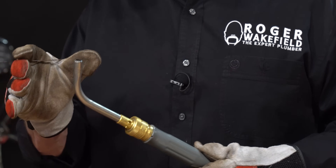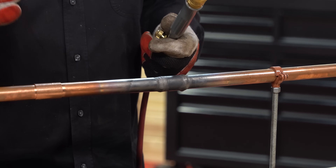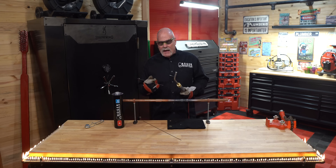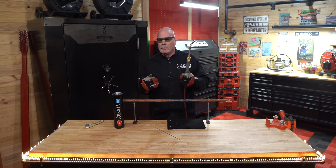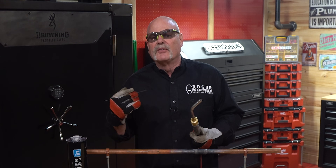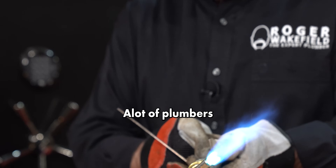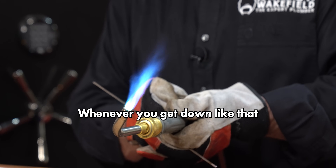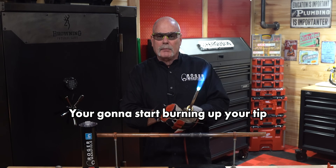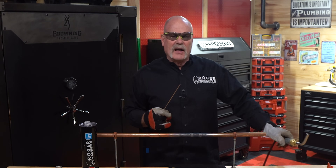You don't want to oversize your tip or just burn the heck out of it. I got it hot enough to braze and it brazed very easily. You've got to have a little more control with the Rosebud because you can adjust your tip and adjust your flame. With the TurboTorch, you just get the flame size the tip gives you. You don't want to regulate it down — a lot of plumbers try to turn it down, but whenever you do that you're going to start burning up your tip. Your tip will actually start glowing red, and you never want to do that.